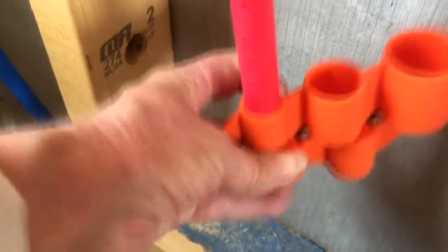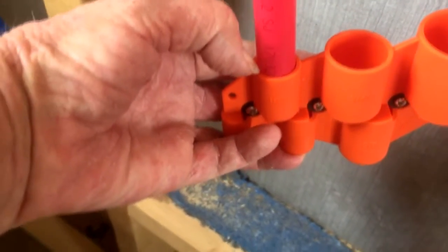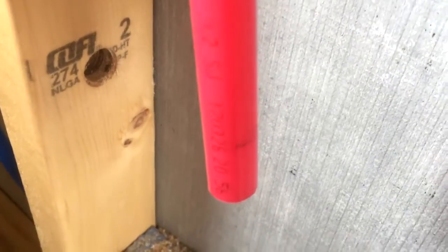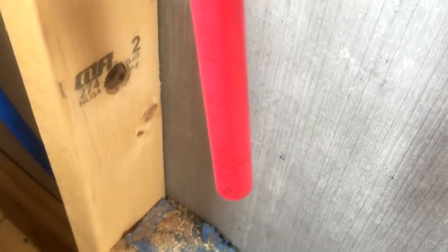The lines I'm going to bring them through here with a 90-degree fitting. What I have here is I cut it off and deburred it to make sure. Now I'm going to put this in here and mark right there - that's the depth that the half inch needs to go into the SharkBite manifold. My line is right there. The SharkBite actually marks between the arrows, but I cut it at a different area so anyway.